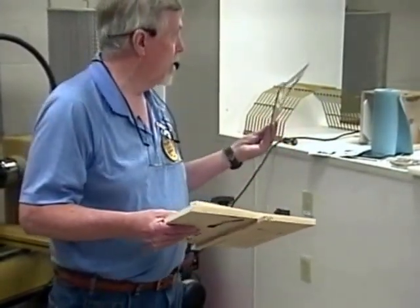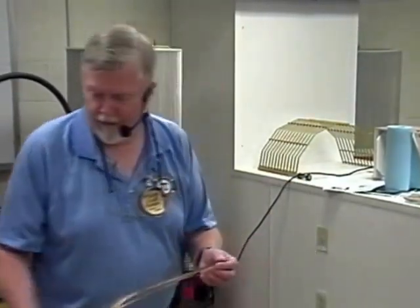Be careful when you buy. There's actually a $3 version of this. Don't buy the $3 version. We found out that the 90 degrees is only 88 and a half. And Al Osterman came up with one someplace, and he couldn't get the rings to fit right, because if you take a half a degree error on each segment times 12, you've got basically a 6 degree error all the way around. So you're going to wind up basically defeating the purpose of buying the Wedgie Sled in the first place, which is not to have to do a lot of sanding. You have to do a lot of sanding to get the rings to mate up.